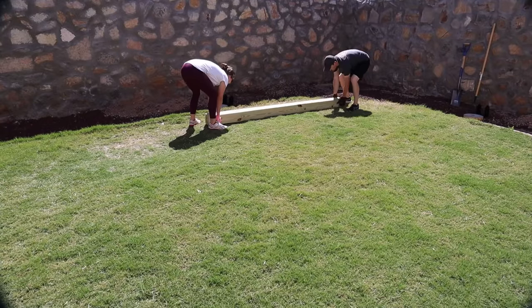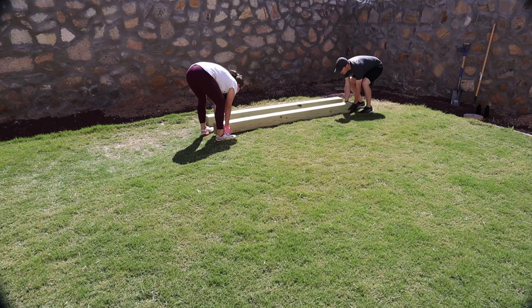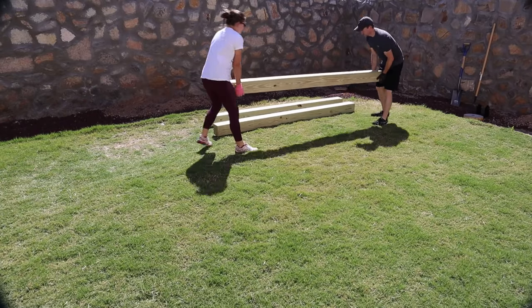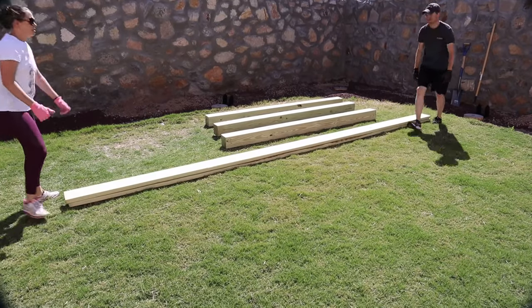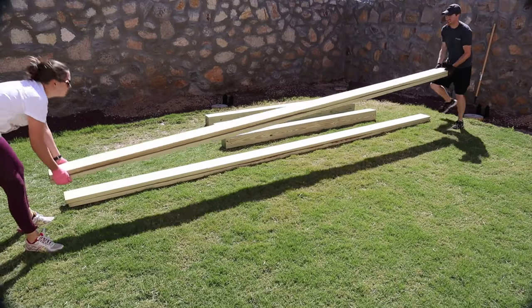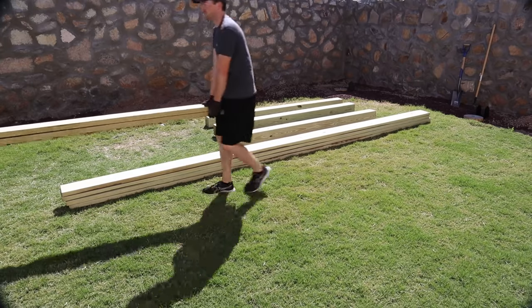We had to make a big decision on what kind of wood we wanted to use to build with. We narrowed the choices down to pressure-treated pine or natural cedar, as both of these types of lumber are good for exposed outdoor structures. In the end, we decided to use pressure-treated pine due to its cost and availability. There are some downsides in working with this material, which we'll get to later. For some reason, cedar is extremely hard to get in our area and would have more than doubled the cost of this project.